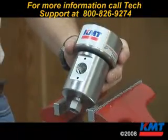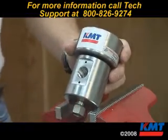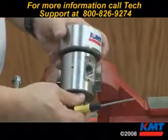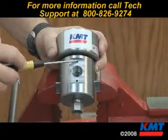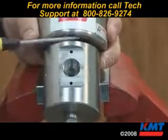This is the normally open pneumatic control dump valve. It is used on our intensifiers to release stored high pressure from the system. This valve has weep holes in it. The top weep hole indicates we have a seal problem. The seal would have to be replaced if water is coming out of here.